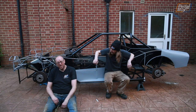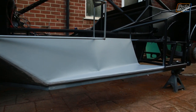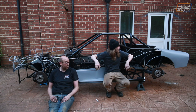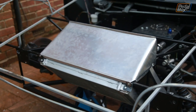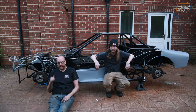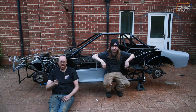I am shattered. Over the last two to three weeks these side pods took the better part of a week to get in both sides and finish up — a lot more of a pain than they look. They look really nice but man, never again. We did some new sheet metal, we did some aluminium at the front of the car, got the radiator duct on which looks really good, and got the little fairings in down the side of the radiator. Working on aluminium is way way nicer than the steel — it's thicker but it's harder to keep a nice finish because any tiny little ding shows, whereas with steel you can knock it and get away with it.